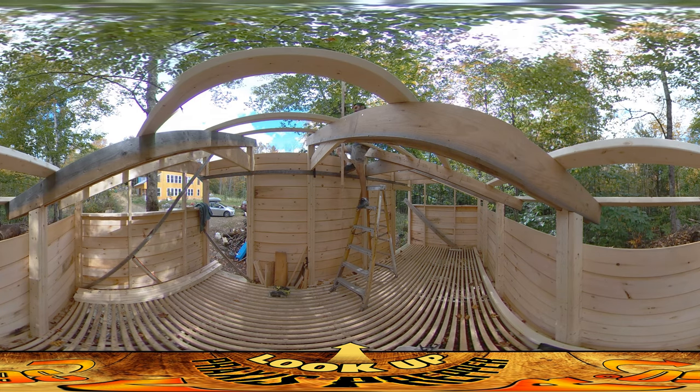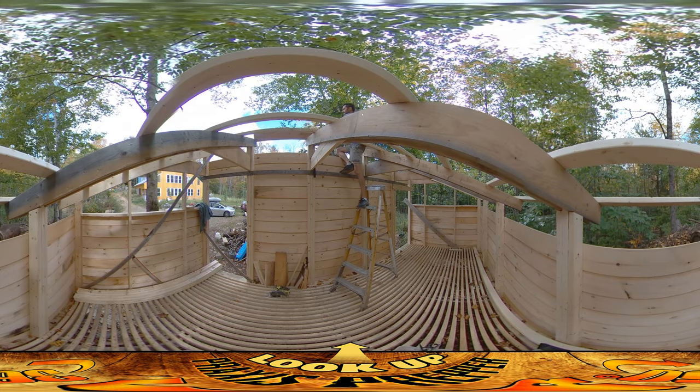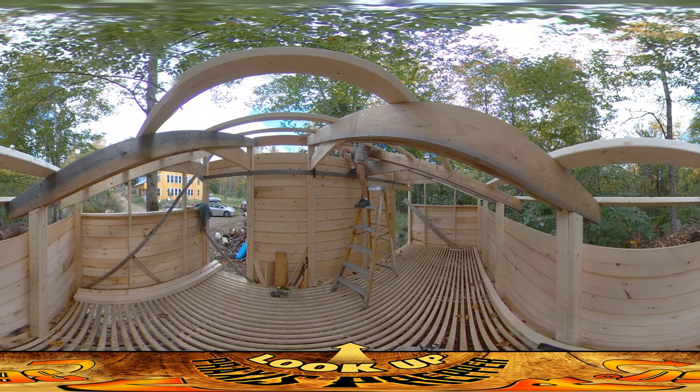This is a 2x8 and they're pretty heavy — it's 125 inches long, which is a little over 10 feet. Once I set it down here, it should be okay. Now it's not so terrible. So I'm just sliding it left to right, making sure it's in the right spot. I'm going to look down from the top to make sure these nails are looking good. Those nails are looking good. These nails are a little off over here — I may actually have to pull these nails a little bit.